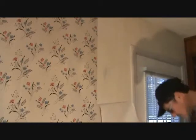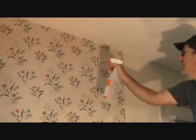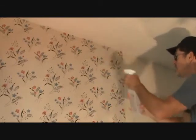Look at that — all coming off in one piece! Wallpaper coming off in one piece, now that's amazing. I've got my spray and I almost forgot — I need to start spraying the next row before I'm done removing the last previous row. Always make sure you work ahead of yourself and put that water down, because you're going to have to saturate each panel a few times.